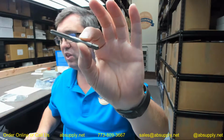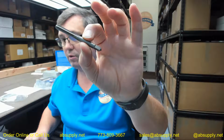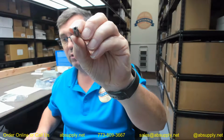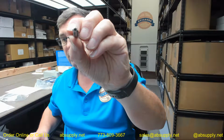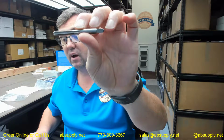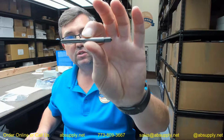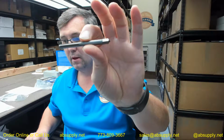The overall length on this tap they don't give, but it's about 2 and 5/8. Ideal for routine maintenance, repair work, and for rethreading where high accuracy and tolerances on your threads are not critical. Straight flutes, ground to provide rapid chip removal for efficient threading. Designed for hand threading work in a variety of materials, and produces a Class 2B thread, bottom style.